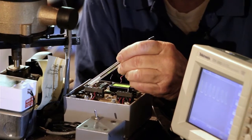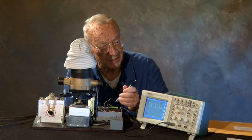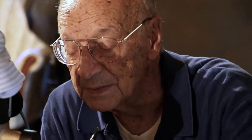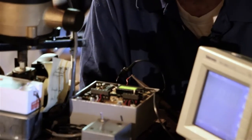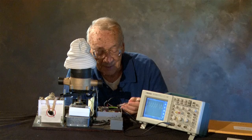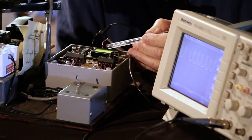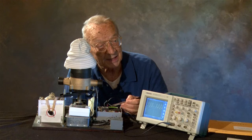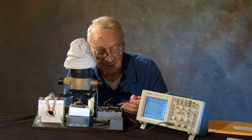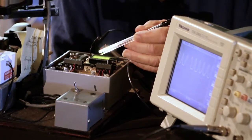The second button I'm going to press and set up so that we detect a medium flow. I'll hit Enter here. This is what we're looking at right now — the medium flow. This part of the liquid crystal display shows the actual A-to-D converter value, and the bottom part is telling us that it's clear. It also indicates at a certain point how many gallons are flowing.